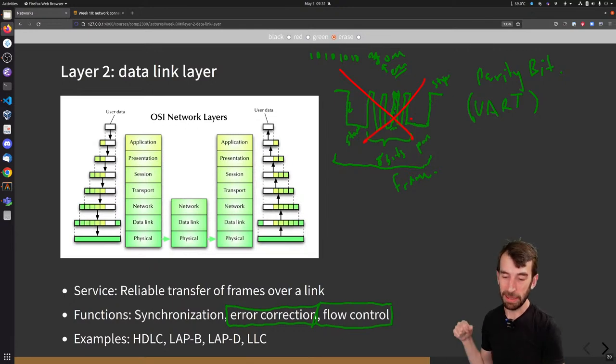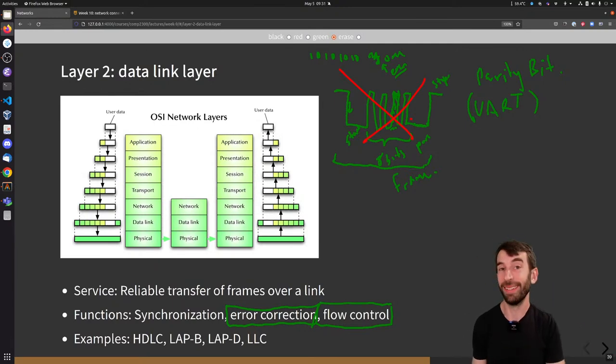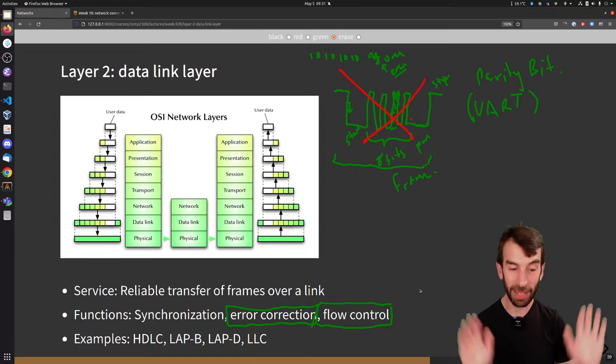So they need to be filling up that data with the hose, fill the bucket up, and then they move that aside, get a new bucket, fill that one up. So there's some extra bit of communication to say, stop sending things, I've got to change to a new bucket or something like that. So you can have some extra connections in UART, or some kind of extra communication between the two parties to say, stop sending me frames right now. I need to get some new cache space. My application layer needs to start sucking things out of my cache because I can't take any more reception.